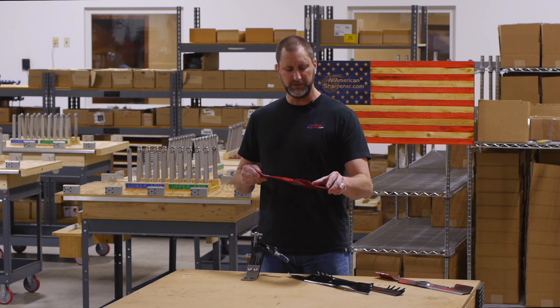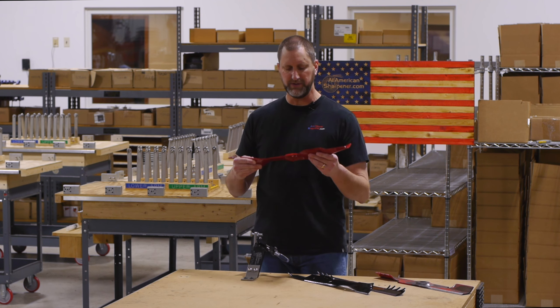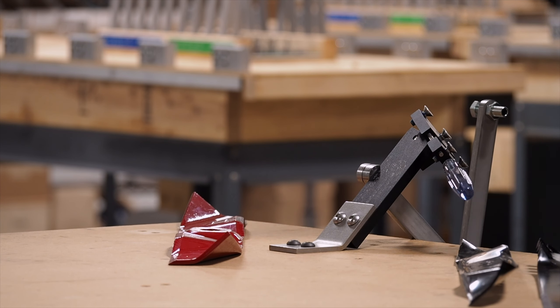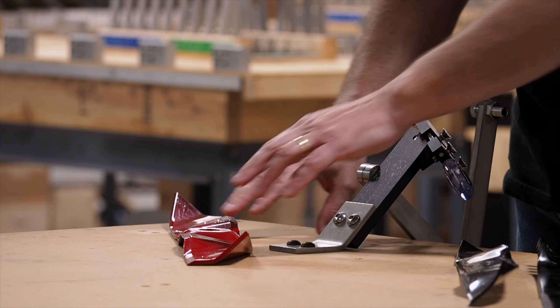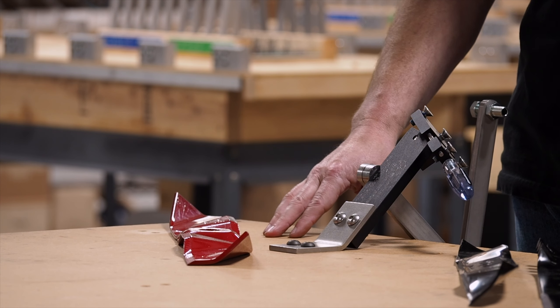With the outer angle you'd be at 30 degrees, and the inner angle you're at 15 degrees — a 15-degree variance on this type of blade. But it needs to be a specific bi-level mulching blade where the outer section is flat to the table if you were to lay it on a table, and then the inner section is raised up by a 15-degree variance.